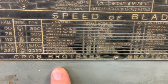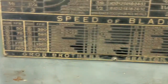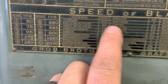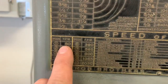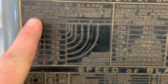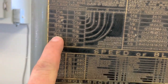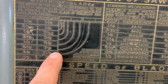The speed chart is based on what RPM you want to run and what material. For example, if you wanted to cut cast iron, you would be on speed number one, which would be 50 RPM. It also gives you a radius chart for the blade — I'm running a 5/16 blade, which can do a certain radius of cut.